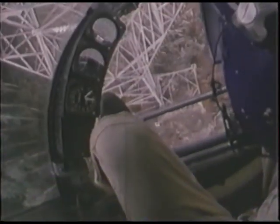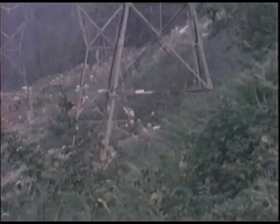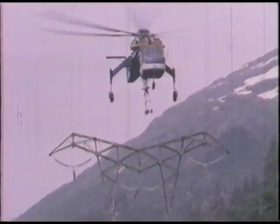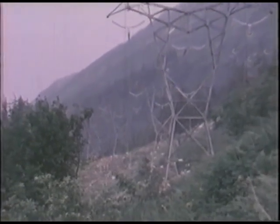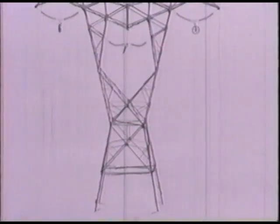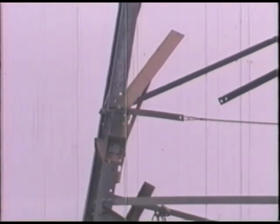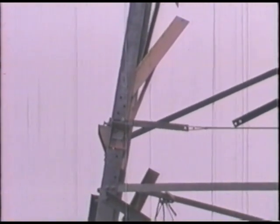Over the site, the sky crane hovers under control of the rear-facing pilot. One Ericsson safety rule is that nobody can be under the tower when it's being lowered into place — this puts the job of setting the tower squarely on the shoulders of the rear-facing pilot. The tower guide system makes this possible: a cable system on the bottom of the tower fits into metal arms extending from the leg sections. The unit is lowered onto the guide arms, and the tower is in place.